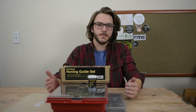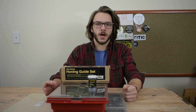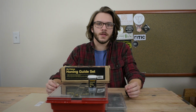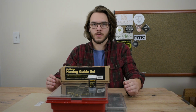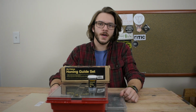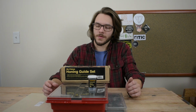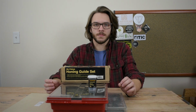I'd put it at my #1 priority because you can get the most expensive tool out there, and if it's dull, it's deemed useless. But if you have a middle of the range tool that you can consistently keep sharp, then it's going to outperform any dull tool. You can go and get a chisel from Harbor Freight, and if it's sharp, it's going to cut better than a dull $100 chisel. It won't last very long, it won't stay sharp,